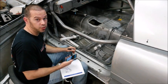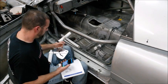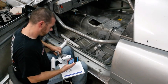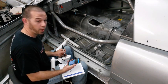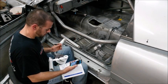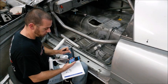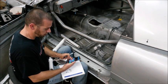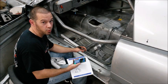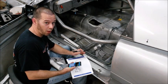Now, if you remember me telling you about the handy little feature that we have engraved right on the cage gauge for figuring out the length of bend calculation. Now, this is a 6.5 inch radius. As you can see, I have the end blocks extended for a 6.5. So for a 6.5 inch radius, it's 1.15 inches per 10 degrees of bend. So my first bend is 19 degrees. So it's 1.15 times 1.9. If I knew how to use a calculator. 1.15 times 1.9. So it's approximately 2.185, but I'll round up to 2 3/16. So it takes 2 3/16 of an inch of material to do a 19-degree bend, and that's to the center line.